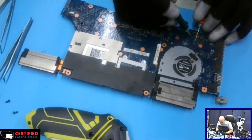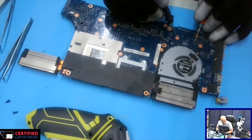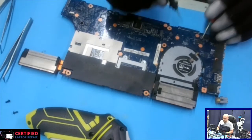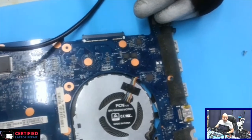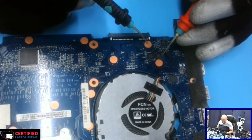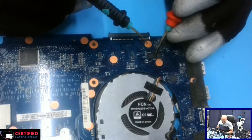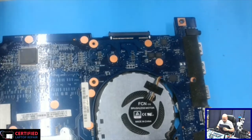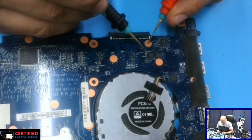As you could see, from the second, it goes to a fuse. And here's a short. Okay, so as you could see, before the second MOSFET, let's see it closer here. So this is the first MOSFET. As you can see, there's no short. It goes to the second. Okay, so as you can see here, the short is right after the second MOSFET, which is on this fuse here.